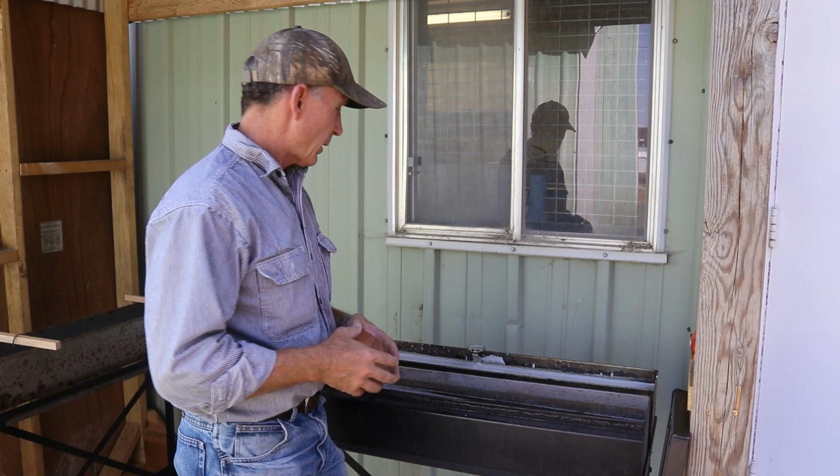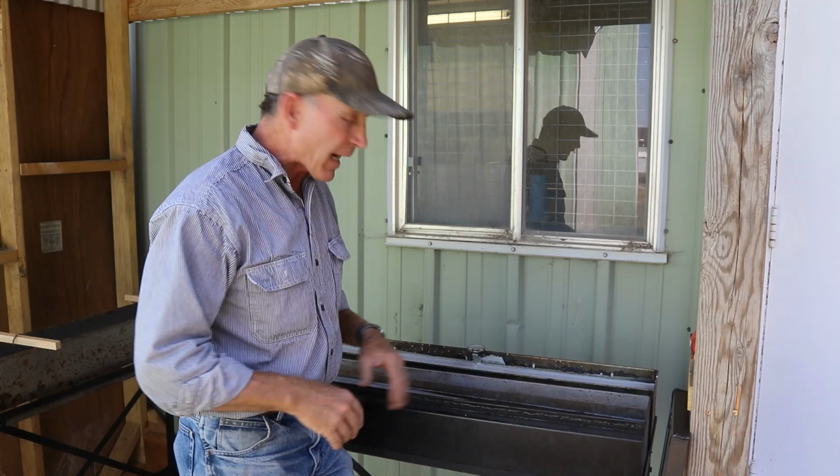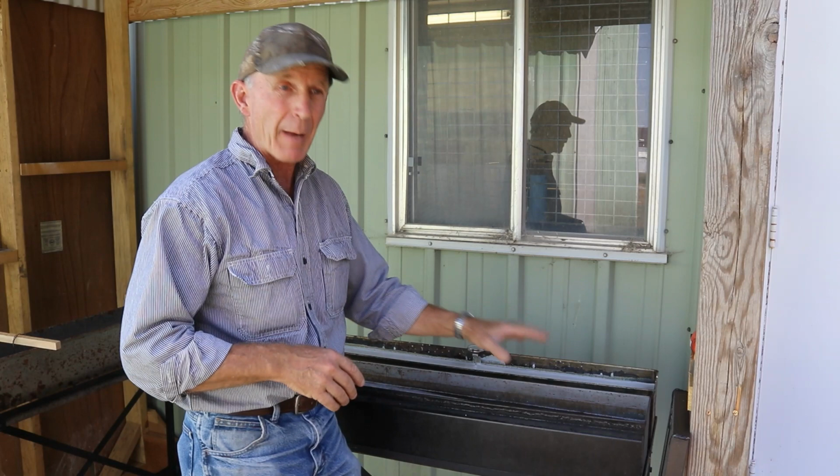Now, while these tanks are heating up, and our bluing tank now is at about 255, let's talk a little bit about heat control. Now, as I mentioned, the tank out front here with the degreaser in it isn't nearly as critical. It can run about 160 to 180. We don't want to get it up to boiling, because that can damage the degreaser. It loses effectiveness when it gets up to a boil. And of course, we're at high elevation here, so we boil at 206 degrees. So we want to make sure we keep it well below that.